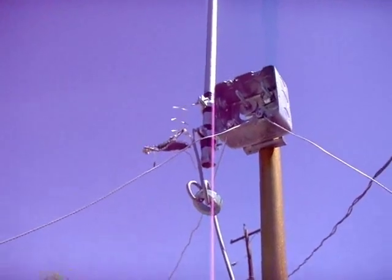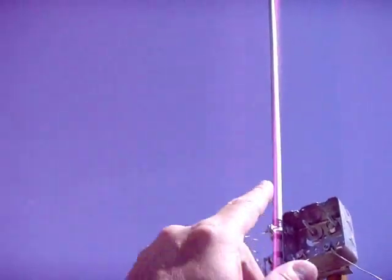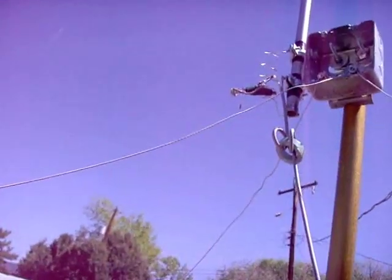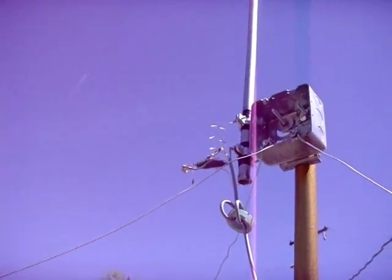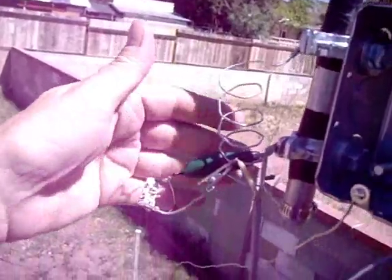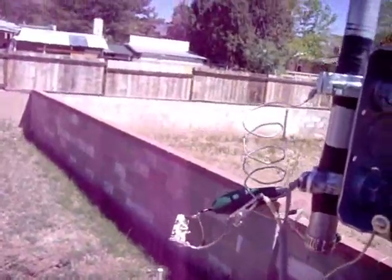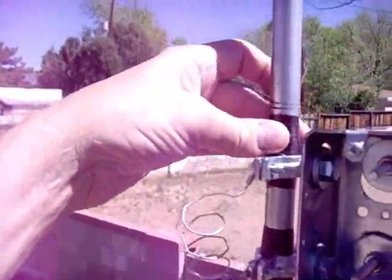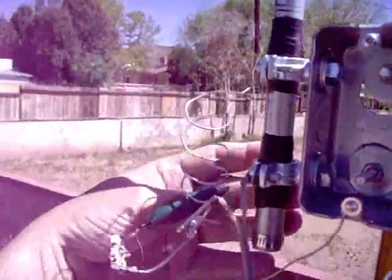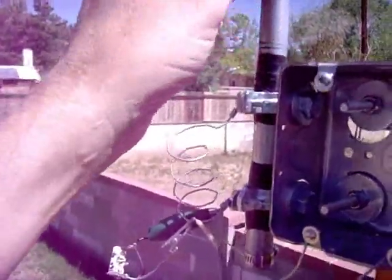This is a homemade quarter wave CB ground plane. It has a quarter wave radiator, and I'm using an electrical box and some plumbing clamps to keep the antenna together. It also has a matching network on it. This is made out of just basic hookup wire — solid wire works well. I've used electrical tape to insulate the actual radiator of the antenna along with those clamps, which holds it firmly in place and insulates the radiator from ground.